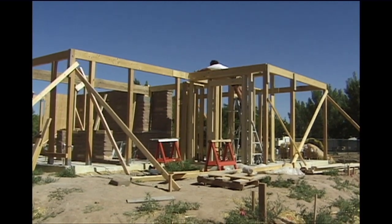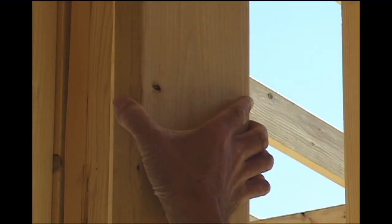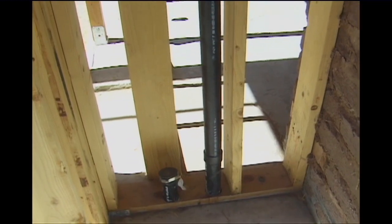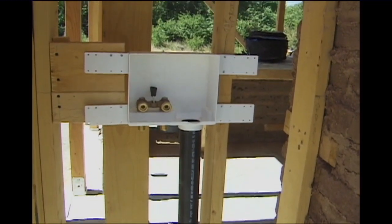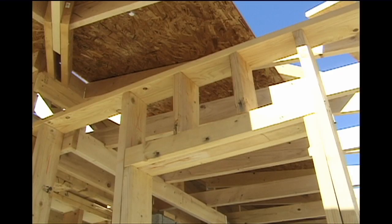The remaining walls within the house are all standard wood stud construction. We're using 2x6s because all of the drain waste and vent piping, in addition to the freshwater piping, will be run within these walls. There are very few frame walls within the house, and the ones that exist are all used for plumbing.